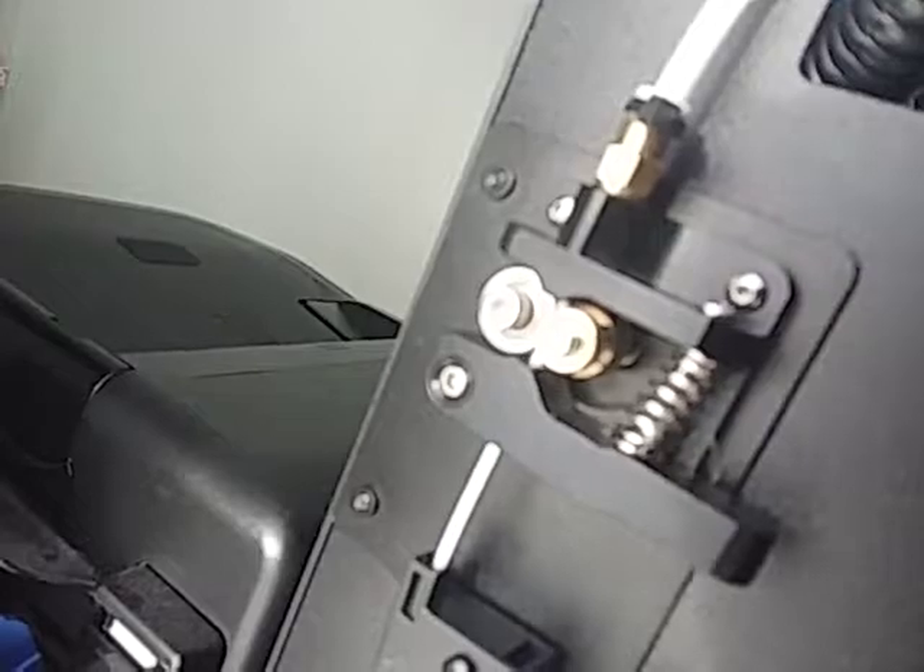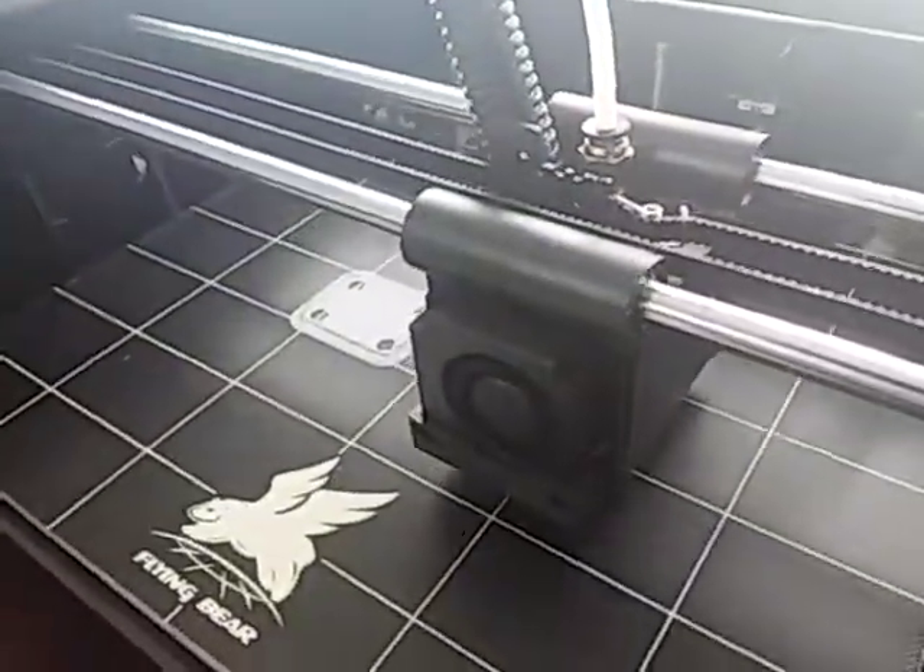Just clicking — it's going nowhere. That means the filament's jammed in the top of the head here, which means I have to completely disassemble that head.